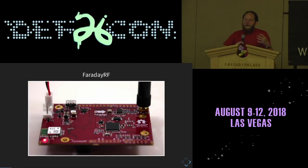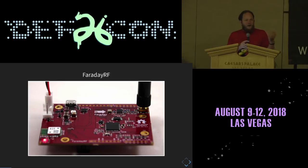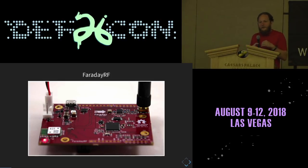There's also the Faraday RF kit, which again uses the Chipcon 430 chip that I'm using. They add a power amplifier for the 900 megahertz band. So you can just buy one of these things and have a half-watt transceiver that's compatible with the wristwatch. Their firmware and their hardware are also open source, although little to no code is shared between them and my watch.